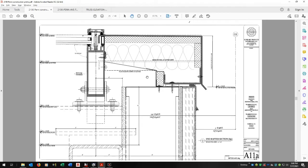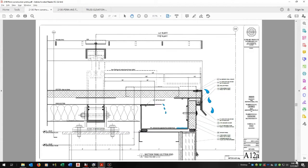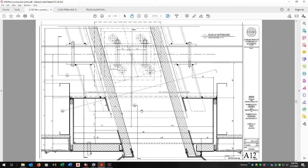This is just drawn for us — one's a valley, one's a hip, but it's so tiny it doesn't affect you. This is the end of the gutter, this is where it gets pretty hairy. Most of these drawings affect us in the shop and the production guys. What you need to know is that there are these boxes that are about 8 by 18 inches at the end of each gutter. Here's the inner liner we talked about before — with the notches to go around the rafter — it lays overlapping a little ledge in the box and it's going to weep into the box. That's the inner layer draining into the box.